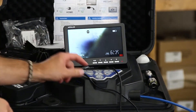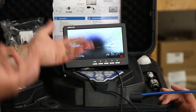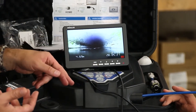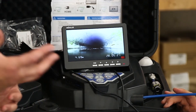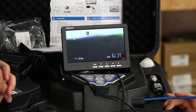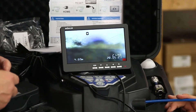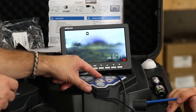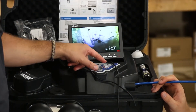Now we're on the water base side. This is an old piping system that doesn't get used for much of anything — there is residual water and you can see there is flow downward. It could mean a few different things: it could be a crack in the pipe somewhere, or some kind of vacuum pulling into an open secondary line. That can be discovered using the 100 feet of cable as well as a locator to find out exactly where the head is. We can also change the angle to face the top of the pipe to see what's going on on the ceiling — sometimes you can find things such as black mold, which in a humid place like Memphis you will find often.